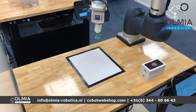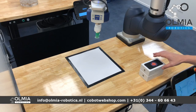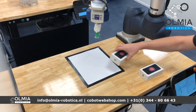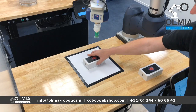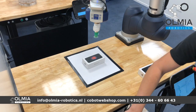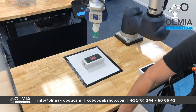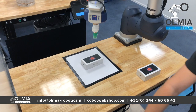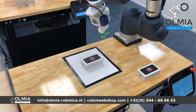In the clip we are seeing the pick and place of the boxes on screen. You can see the Doosan Smart Vision Module mounted on the robot tool flange. The robot picks the product up and then places it to the side. The advantage of having a camera on the tool flange is that you can mount the robot anywhere and do inspections of any surrounding within the robot's working limit.